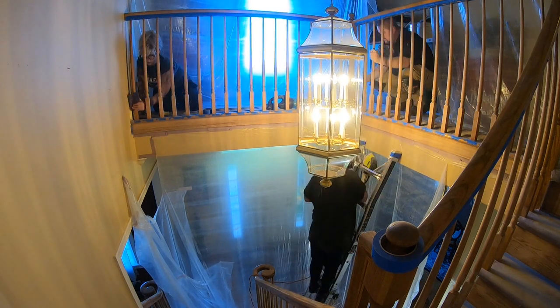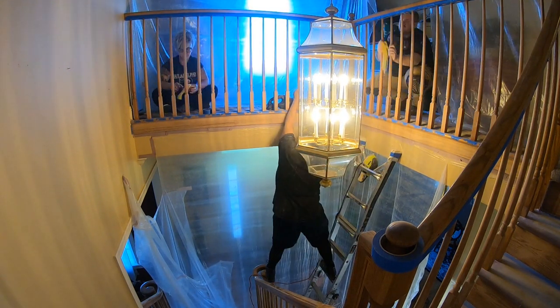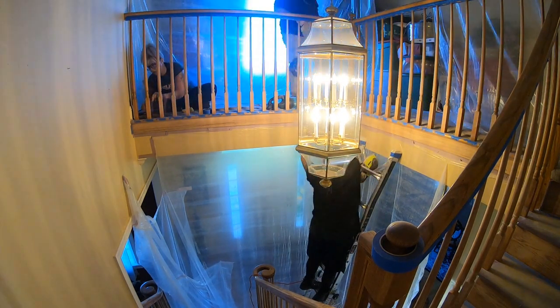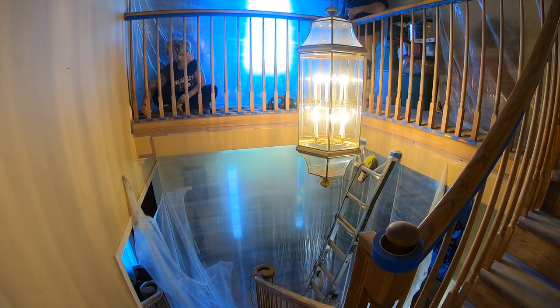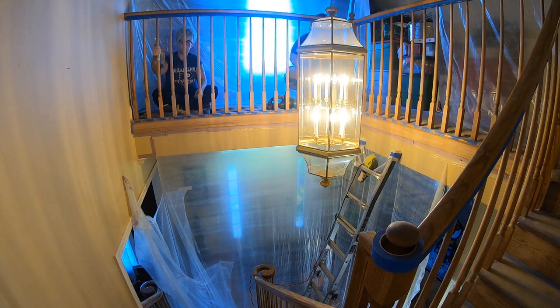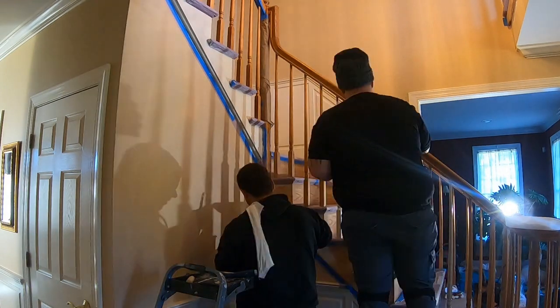We usually start with an 80, working our way to a 220. It's very tactile. You can look at it, but you almost gotta feel and know when you're done. We've done this so many times that usually by touching, feeling, and observing the grain, we know when it's time to stop and when we can proceed forward with our first coat of paint.